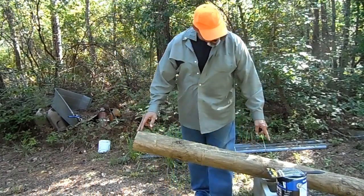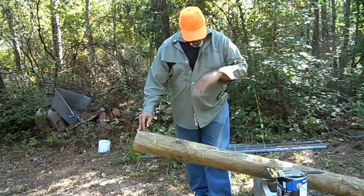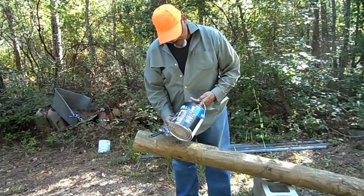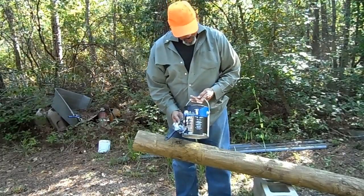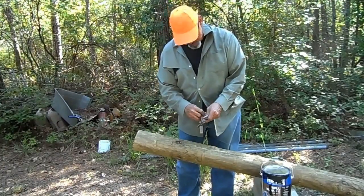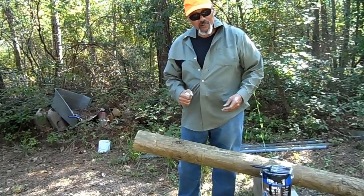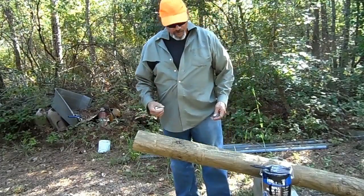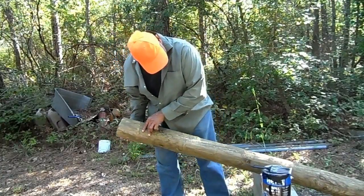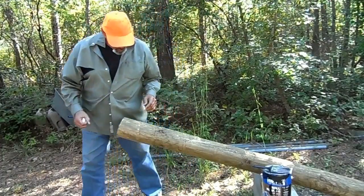Before putting any of these poles in the ground, I'm going to check on the gate I'm putting back there — I'm putting two gates. Before I set these poles, I'm going to coat the ends of them with some of this roof tar. It has asphalt in it, so I'll smear that on, let it sit for a day or so, and then put them in the ground. It's not going to keep them from rotting forever, but it'll last a while. I have some in the ground now that have been there 16 years and haven't even budged — and they're not rotten at the bottom either. This is about a five or six inch diameter pole, and that's what I'm going to use.